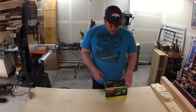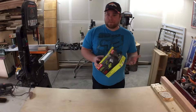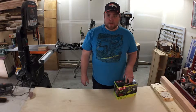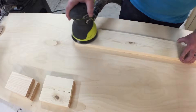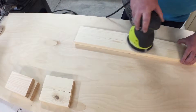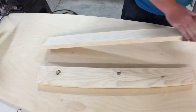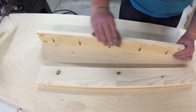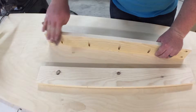I just got back from the store with another cheap sander just to finish up this job. The sanding is pretty straightforward — just sanding at 120 grit and breaking all the corners, as you can see here.